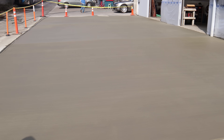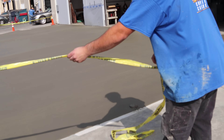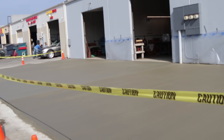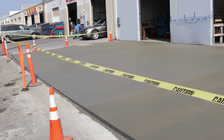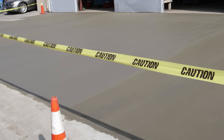We're going to be striping this parking lot — I'll have a striping guy come out and put the parking stalls in. Here's the finished product. It's a little rougher than I would do a residential driveway because this is a commercial setting so it's going to take more of a beating. You're going to get oil on there — it's a metal shop inside with a lot of automotive in this area, so you need some good texture.